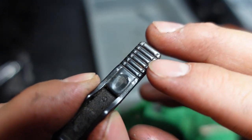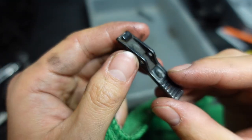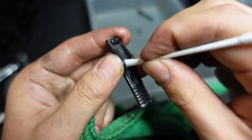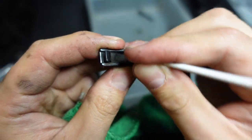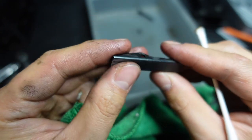So we have a little bit of corrosion right here. We're gonna have to wire brush it out before I dunk it in the tank. This particular one, I'm not sure if I can uncover the subcontractor marking more clearly. Seems to be stamped by the Cura company, which is based in Geneva. They were experts in deep drawn, thick sheet steel parts like this one. Pretty interesting.